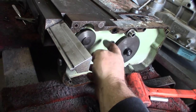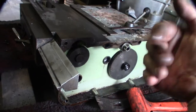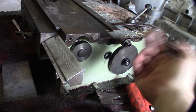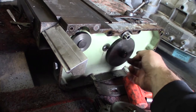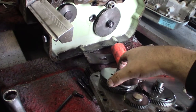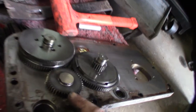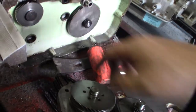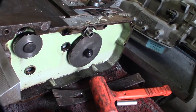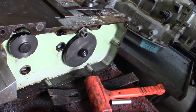This piece was part of the mechanism that would turn this gear - it's the drive gear that drives the axis. There's just so much slop in all these little gear teeth - every single gear tooth has slop. Who knows how much total slop was in this thing with every gear tooth contributing. That's not going to be good enough for CNC - at least not good enough for me.